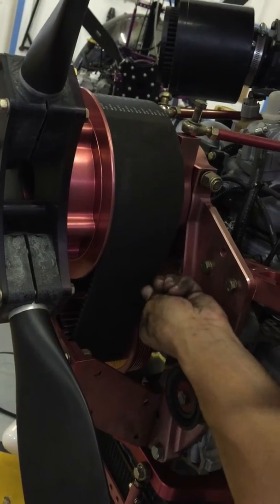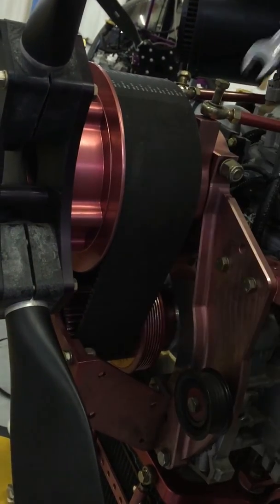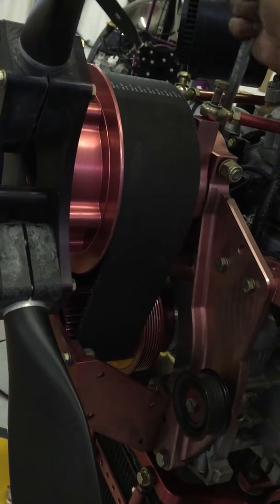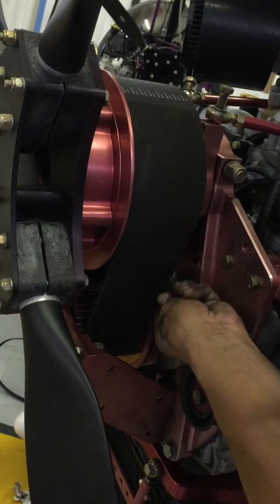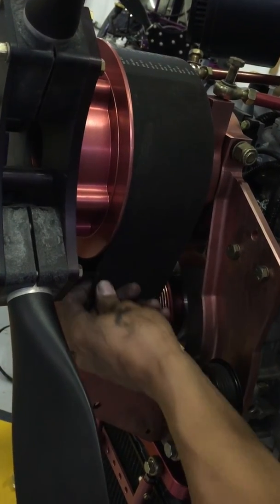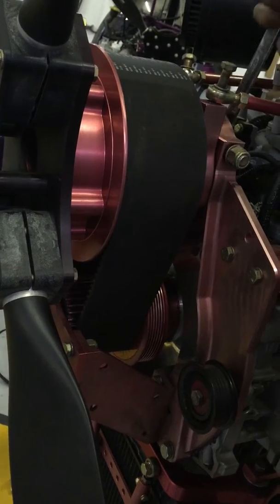You're going to feel it's going to tighten only at the back and not in the front, which is fine, but don't over tighten it at the back. Just give it a little bit of slack so that it's still tight. Tight to the back, 1.5 of the belt width, and then it's still loose in the front. Okay, I'm going to keep that up there.